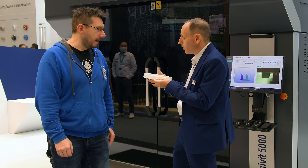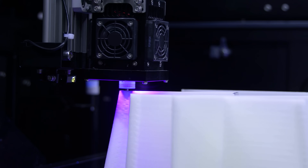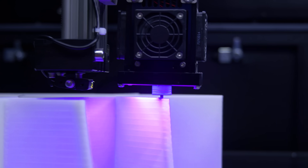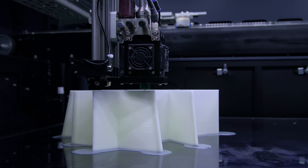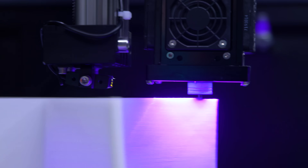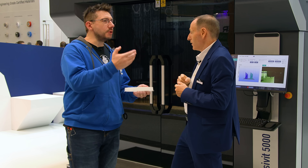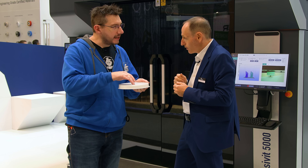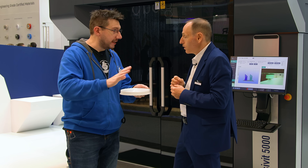GDP — that's the acronym. And it's a gel, very similar to the viscosity of a toothpaste or a hair gel. We bring the material half-baked into the machine, and with a UV LED lamp we polymerize it, cure it — transform it from a gel to a solid-state material. But you're doing that fast enough to not require supports underneath. Exactly. We're not only able to print layer on layer, but we can literally print layer near layer. So as you're doing the gel deposition, as long as the gel you're depositing can touch cured gel that you've already printed, you can just cure it in place and keep going. Instantaneously.